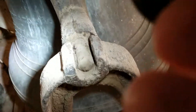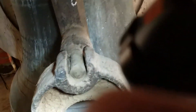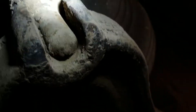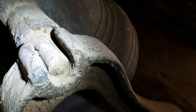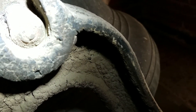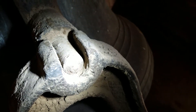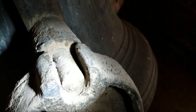The next thing we want to look at are the bearing points. This is where the bell actually pivots as it swings — that pin is what pivots. This should be cleaned out and greased at least once or twice a year. Here you can see that this bearing shaft is very, very dry with a lot of grit and dirt in there. That metal-on-metal contact makes the bell harder to swing and causes more vibration than necessary, so it needs to be cleaned out and packed with grease.